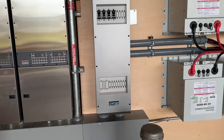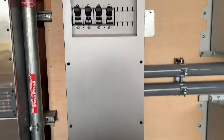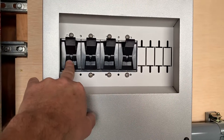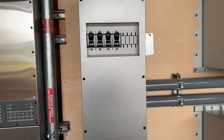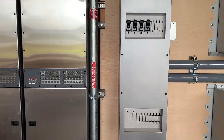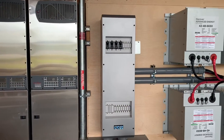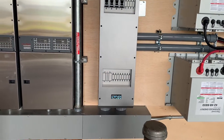I like the FlexWare 1000s — you guys see these a lot in my installs. It is a little bit tight; it could be a little wider, but you can see all our breakers here. I did 175s — we'll never hit that potential — and each battery has its breaker. These are 130 amps continuous but can surge higher. With this system design I'd never expect them to hit that; we only have two radians, each can do 250 surge, so we're well within the means. We've got room down below to add other stuff.